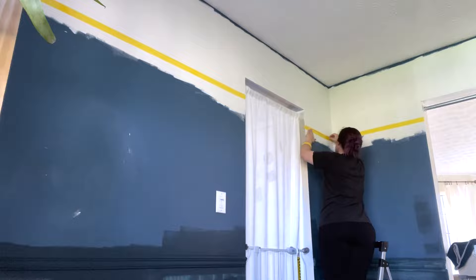So we've got two quick tips. One, right now what I'm using is delicate surface tape, because I've recently painted the upper part of the walls and I don't want that paint to peel back off. If I use traditional painter's tape, it might happen. So instead I'm using delicate surface tape that's meant for recently painted surfaces. Then I'm trying to get a crisp, even line. I want to show you a trick — painting it first with the top wall color, and then painting it again with the lower wall color to create a nice seal on that line.